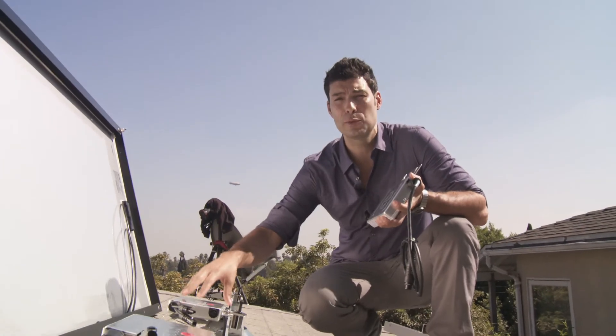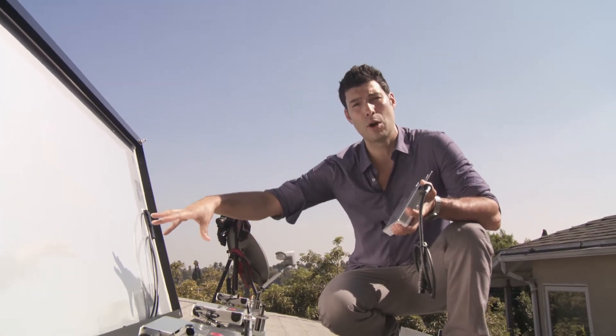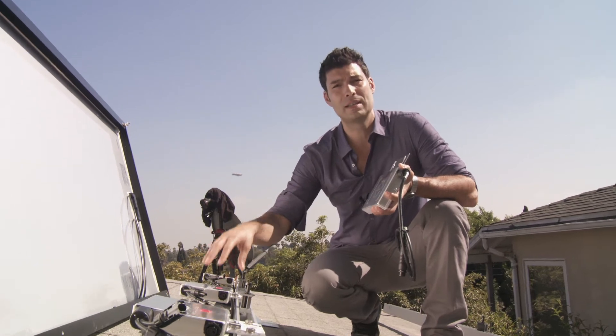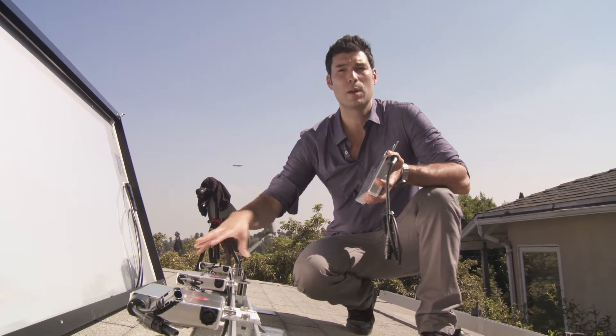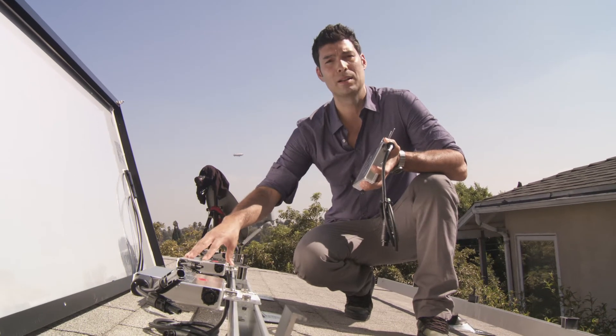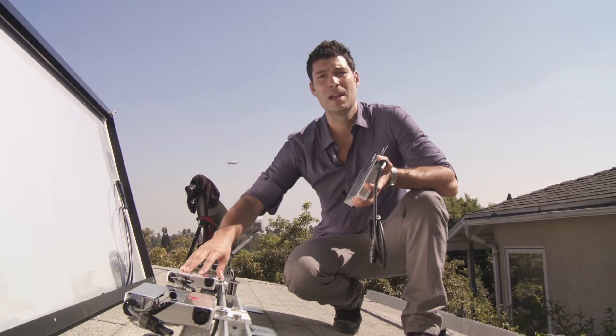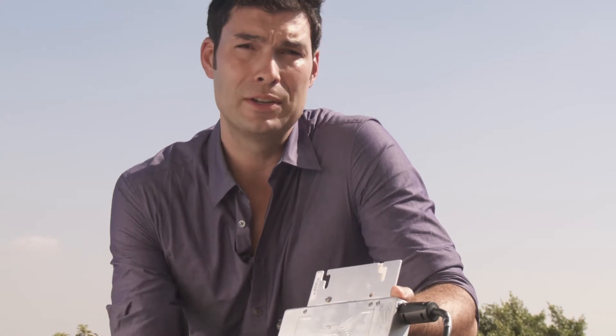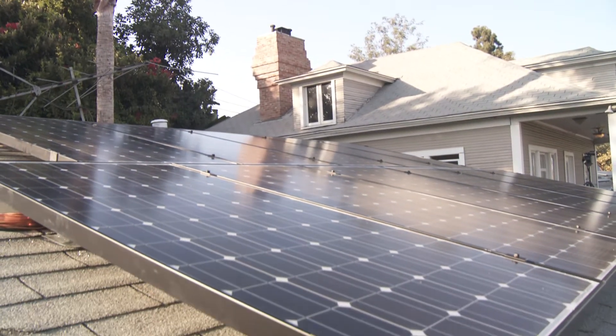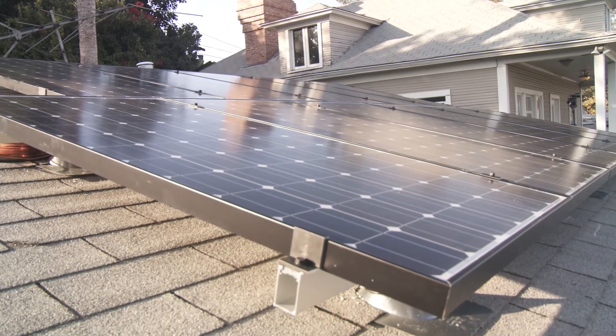This is your second inverter technology — a micro inverter. What's unique about a micro inverter is it attaches at the site of each panel rather than on the side of your home, and it converts DC power to AC power right at the panel. This provides incredible flexibility because each solar panel becomes a separate entity and can be at a different pitch and orientation without affecting the array. Also, since stringing isn't necessary, if one panel is shaded during the day, it won't knock out the entire string of panels like in a traditional inverter system. The only downside is it's a relatively new technology, so it doesn't have a lot of track record.